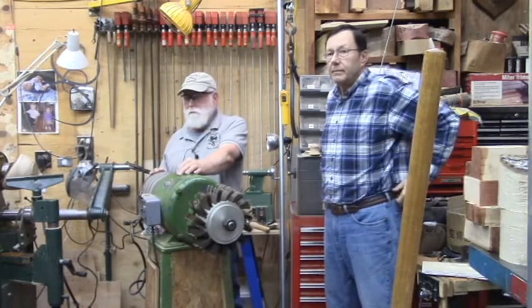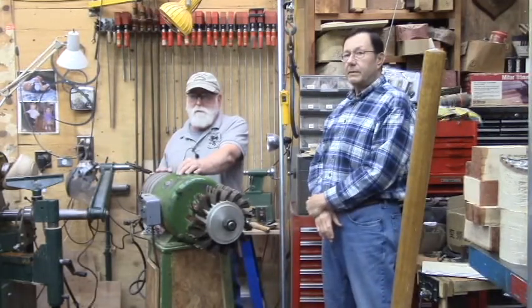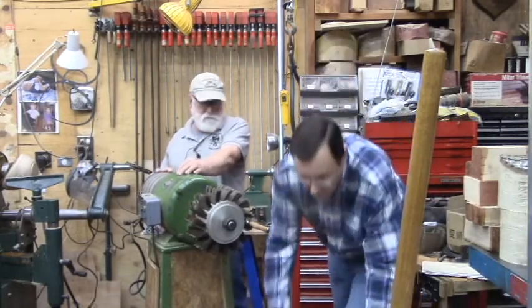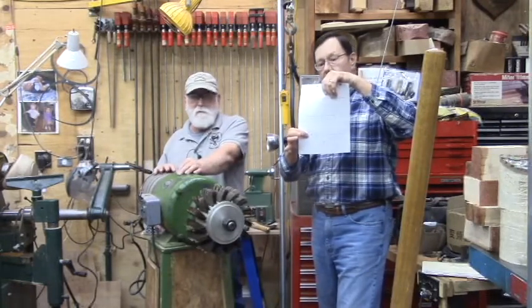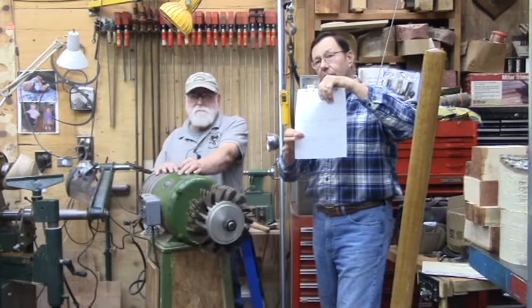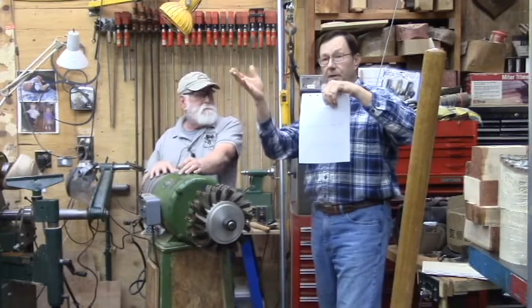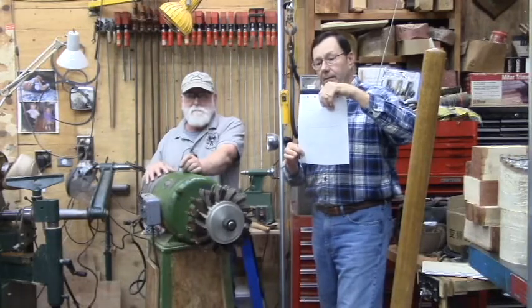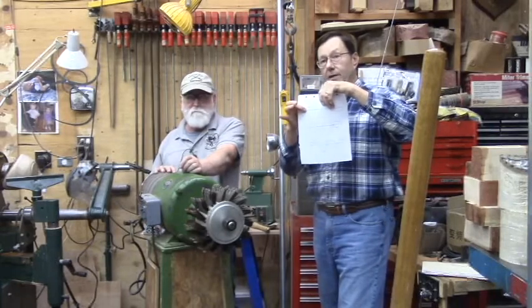So why would you have a 220 converter hooked to a 220 motor? Why have a converter other than variable frequency? It's the phase issue, to generate that third leg. So there's 110, there's 220, and here's three phase. When you need to generate that third phase, that's what an inverter does. The inverter does two things. For yours, it steps up the voltage and then generates a third leg so that it gets you three-phase power. The 220 ones take the two in and generate the third. But in yours, it's going in at one and generating three.